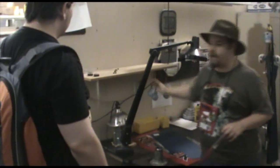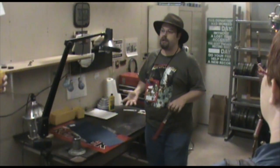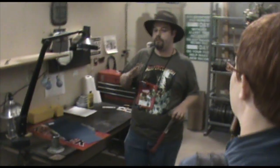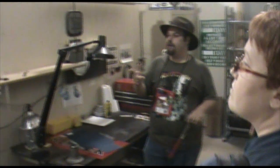So Kevin does what he has to do. He says the proper incantations. He makes it survive the pressing process. We'll take that mold back into casting and generate about a dozen or so metal copies. Those metal copies we call our masters, and those master copies will be used from that point forward to make all future production molds. Did you have a question? No. Okay, you look like you were about to ask something.